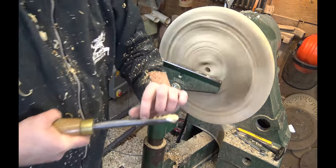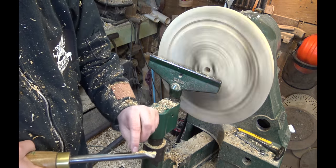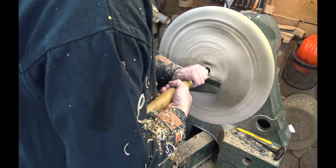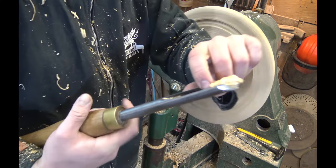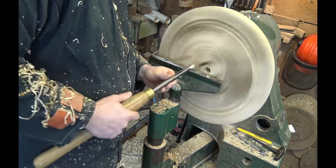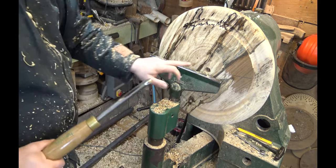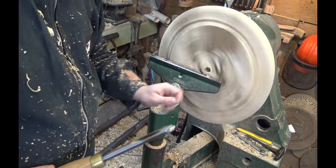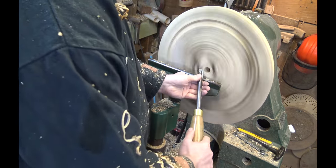This is a little tip I picked up from Tobias K, the brilliant wood turner — he does this with a lot of his bowls to get the depth. You can see how mulchy that spalted stuff is that we're going into. That's about right — I don't want to go any deeper than that hole, as it'll stop me from going through the bottom. Now let's do the easy bit and turn into the center.